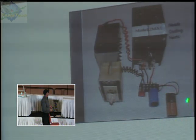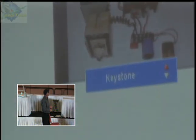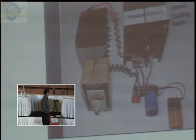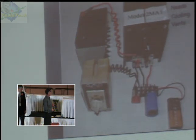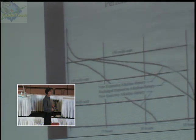And I discovered that non-rechargeable batteries will recharge. One of the tricks is to have a timer on it. The reason they say you can't recharge a non-rechargeable battery is because you charge them too fast and they warm up and they can split apart. But if you do them in little tiny pulses like that and use a timer, you can recharge your Duracell batteries. I always buy Duracell because it's a $4 battery.